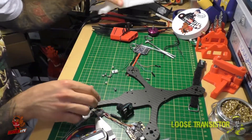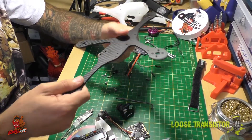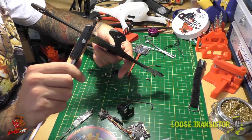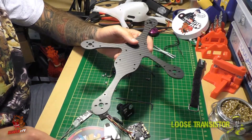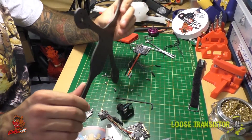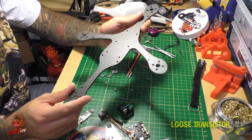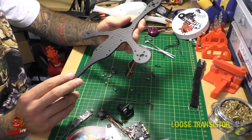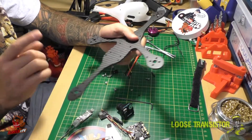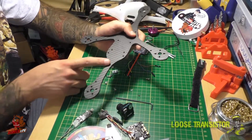The carbon is super light. Let me check the thickness — roughly 3.06mm, so essentially 3mm carbon fiber. That's a little less than I'm used to; I tend to go with 4mm. The arms look very thin as well, so I'm going to have to be careful not to crash this too much. It would be nice if the front arm were removable, because that long arm is probably the most likely thing to snap given the forces acting on it.